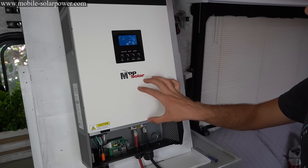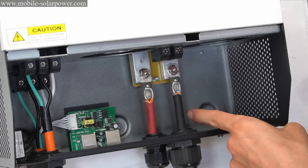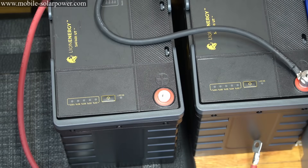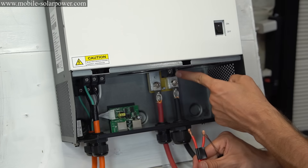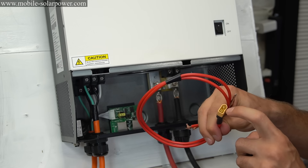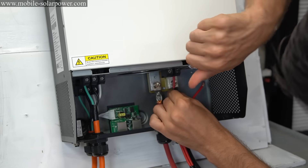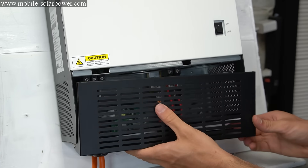Now we're going to learn how to connect solar panels to this system. These two terminals are where the solar panels connect, but they are live wires so we don't want to get shocked. We'll disconnect one of the battery terminal leads so these don't have any power. Now with no power from the batteries and AC input not connected to grid, I can safely attach these wires. I'm adding 10 gauge wire as the solar input, with an XT60 connector to connect to the solar panels. Put the negative on the right where it says PV minus, screw it down, then the positive wire.